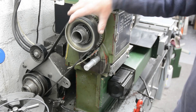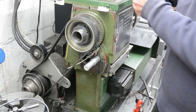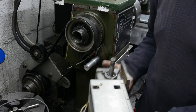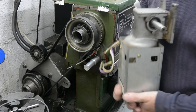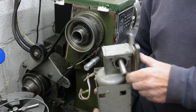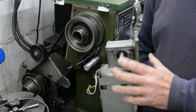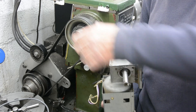Regarding the motor, I found this one in my scrap box. It's an induction motor with a cooling fan at one end, and at the other end it's got a reduction gearbox. The output from the gearbox is 76 rpm, so I only need a two or three to one reduction to get down to the spindle speeds I'm looking for.